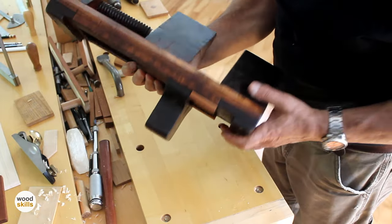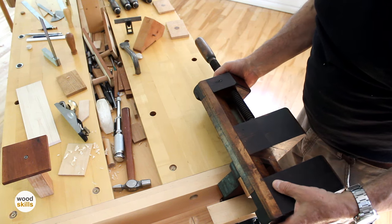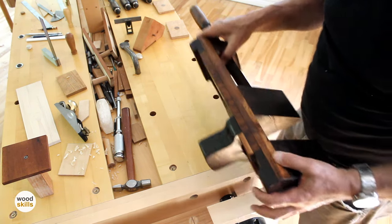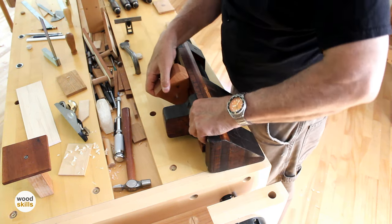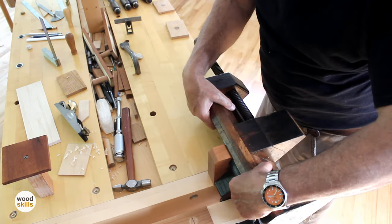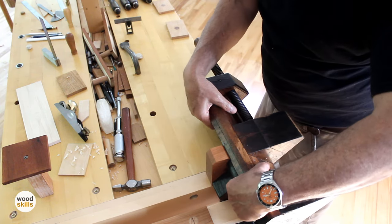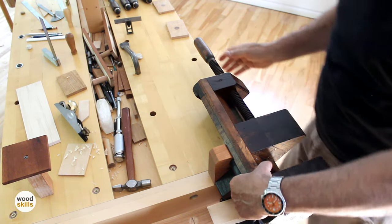This is original. Again, I can mount this at the end of my twin screw vise and orient it so the faces, the 45 degree faces, are horizontal. In order to do that, again, I've had to create its own custom mounting block. This is also a plug-in block. Yes, I got it right. So that plugs in. It's a cherry block, and it plugs in through some dowels. So that stabilizes it when it's in this orientation with the 45 horizontal.